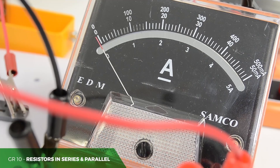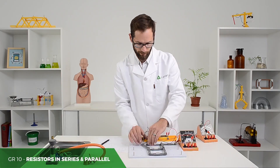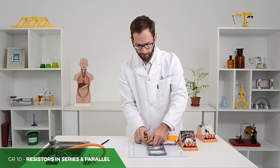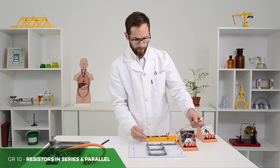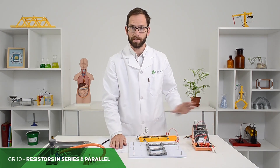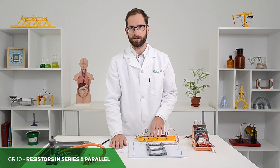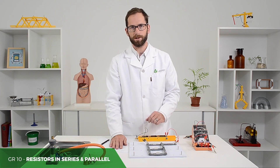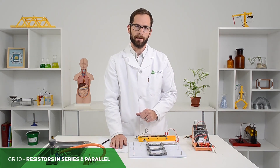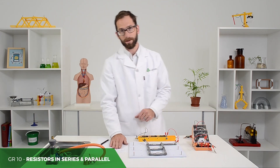Take my readings for each of those resistors. And there you have it — how to set this up for the series and parallel activity. The important thing in this activity is to get accurate readings in the tables, and they can do this a few times until they are comfortable. Then once they've done that, they interpret those readings in terms of which one is a current divider or voltage divider, and whether the current is going to be stronger or weaker in a series or parallel circuit. As a class you can also discuss that. I hope you enjoy discovering more with these.